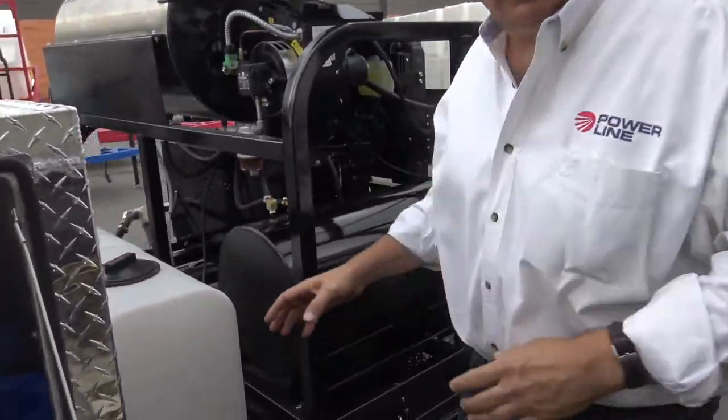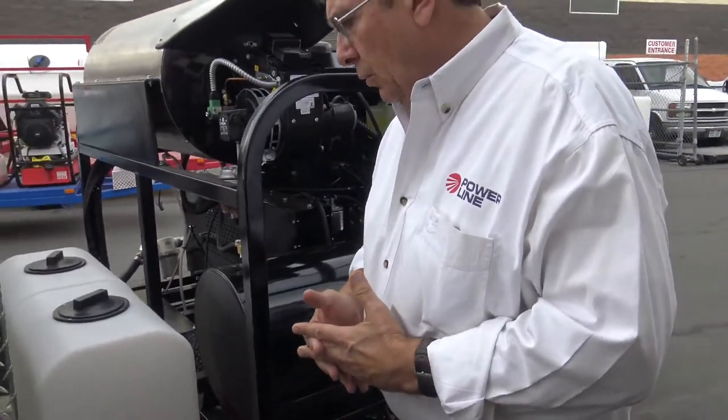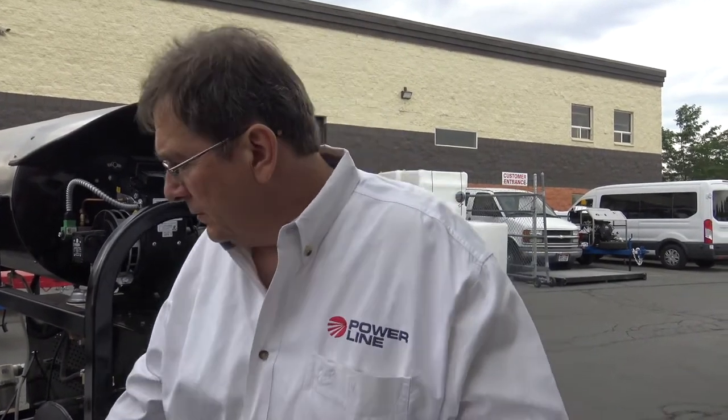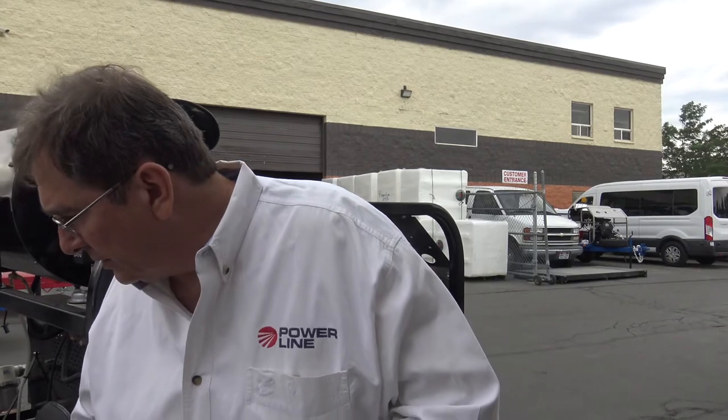Now soap. I like to talk about soap a little bit. So it's been proven. Johns Hopkins University's proven it. To break the film on the pipe, you have to have hot water and soap. That's what we've got. If you break the film on the pipe, you got a better clean, just period. Then you don't have to clean the transport lines nearly as often. Okay? So a lot of guys will use the soap.